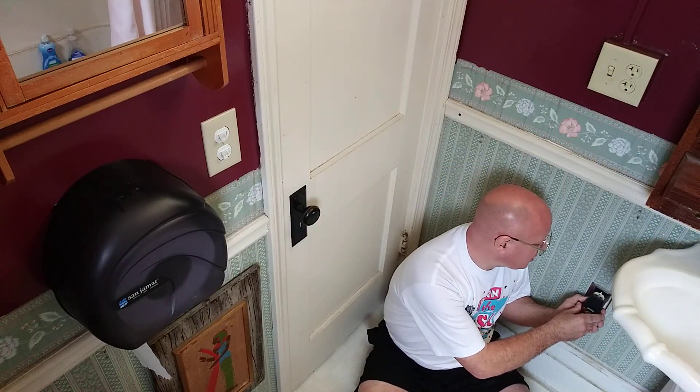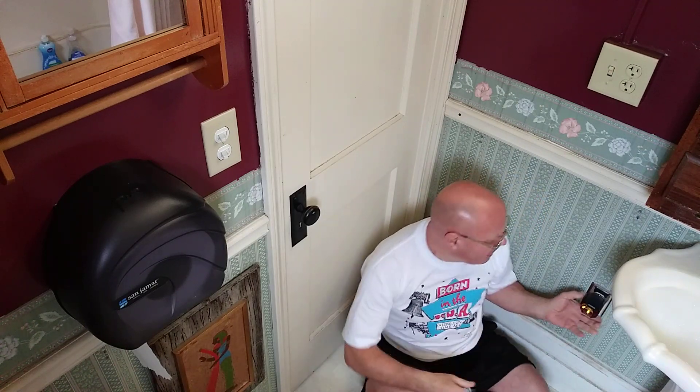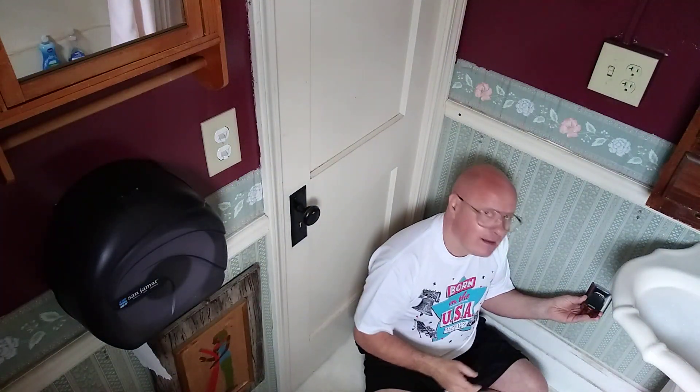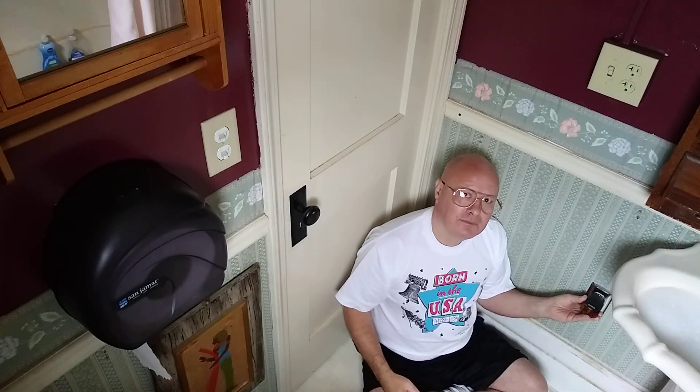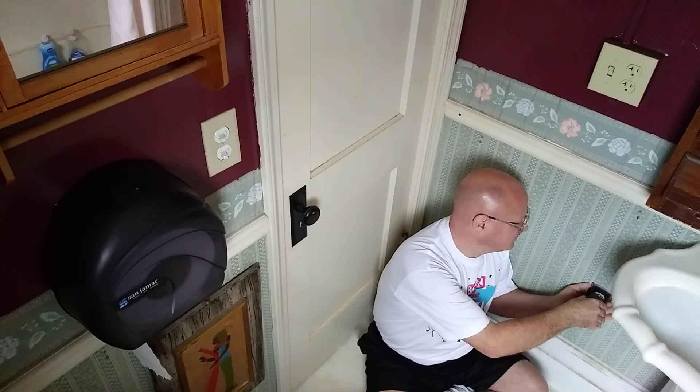The ground hole is up on this one. The light went off and the GFI breaker tripped. We'll go downstairs and turn our GFI on, and I'll show you that this tester had turned off the GFI.